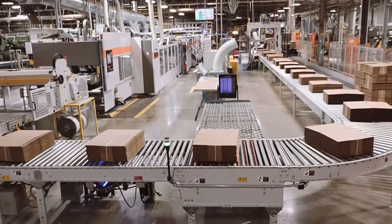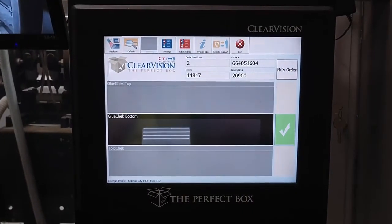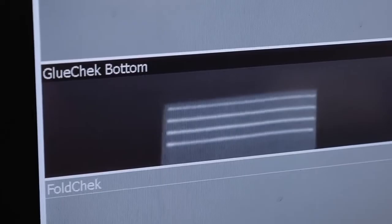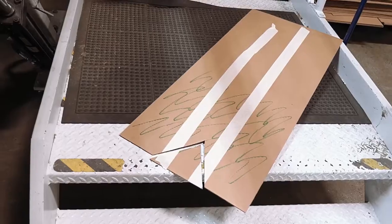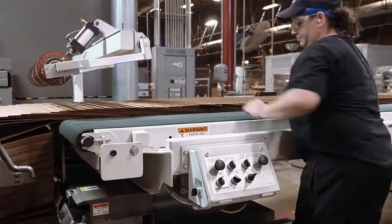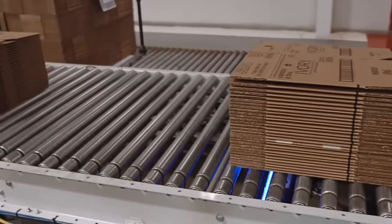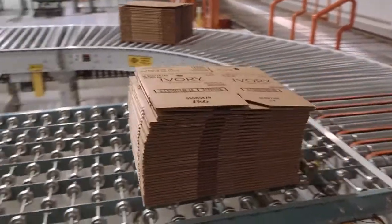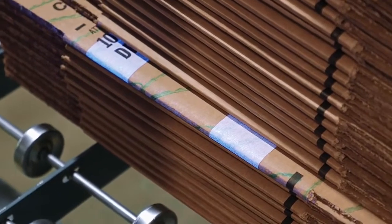To aid in the quality process, especially at high speed, a high-speed detection system called ClearVision is used to monitor glue placement and gap measurements on every box. A high-speed camera is placed at the point of glue application and can detect the amount and thickness of the glue lines, as well as the measurement of the slots in the front and back of each box. These measurements are compared to a developed standard that can predict whether a bad box will be produced. Any out-of-spec box detected will be sprayed with a UV coating, and the bottom of the bundle will also be sprayed. As the bundle travels down the conveyor system, a black light detects the UV coating and ejects the bundle so that an operator can locate the off-quality box and remove it prior to reaching the customer.